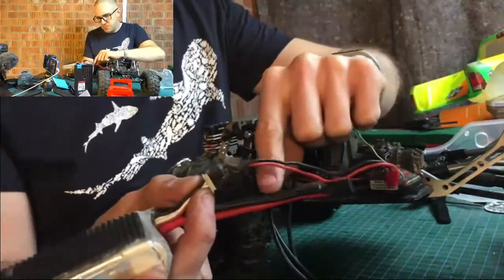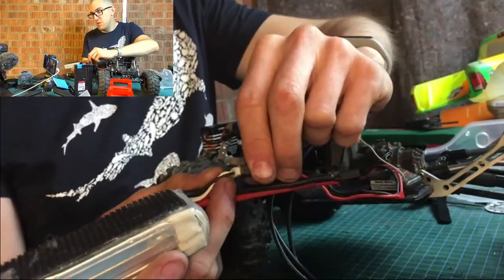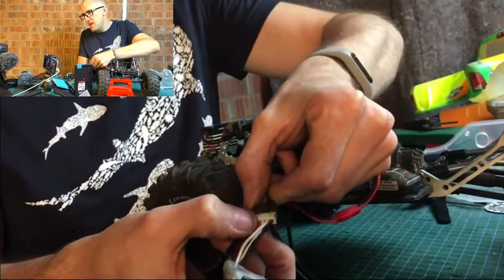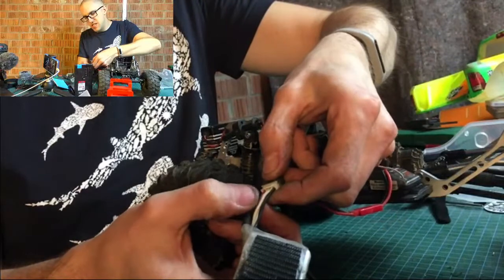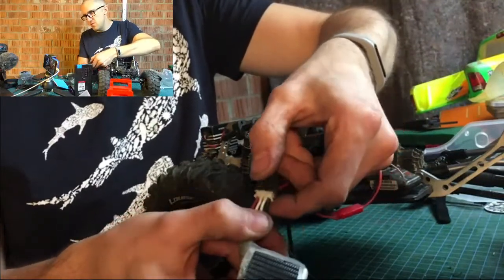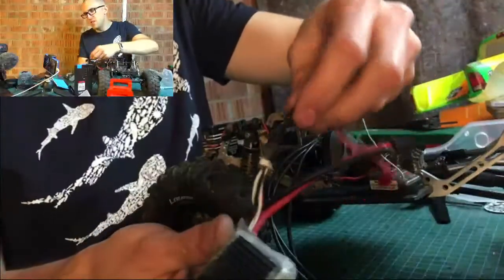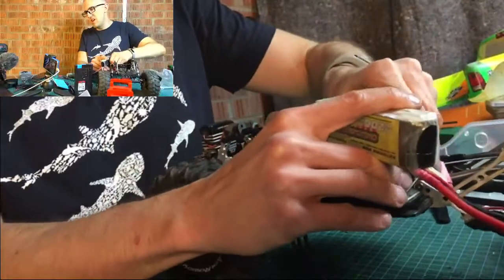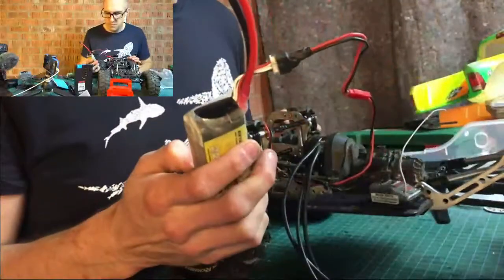You can also make these leads to work off these other ones. So if your servo can be powered by 7.4 volts, or if it'll take 7.2 volts, it'll probably take 7.4 volts, then if you use the pin that's next to the red one, so one away from the black one, each of these leads gives you a different voltage. So you start with 3.7, 7.4, 11.1 on the outside. So if you pick the one next to the red one and then the black one together, you can direct drive your servo that way. Although you do need to then make a splitter to make sure that your servo doesn't put any power back into the battery. But the way to do that is the same way that the direct drives work, and they just have the signal and the negative and no positive going back to the receiver. So you just create yourself a little Y adapter for that.